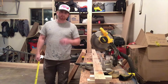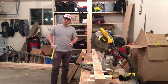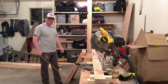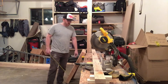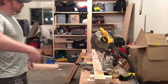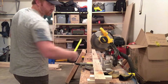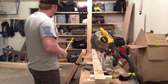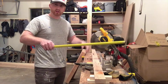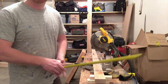The 2x4s running long on top of my workbench total 28 inches, leaving 2 inches on the working side just in case I have to clamp something down — you never know when you'll need to clamp something. So 2x4s cut to 25 inches will separate those 4x4s. With spacing at one and a half inches a piece, I'll be cutting four of those: one for the top on each side, and again about 10 inches off the bottom.